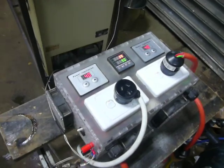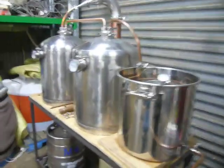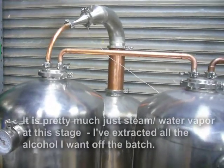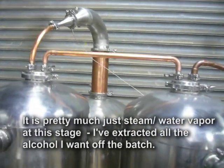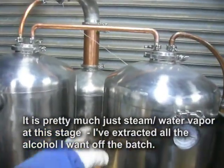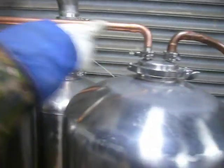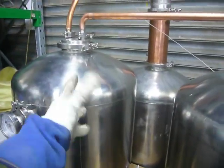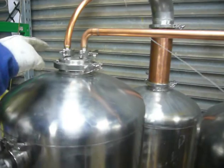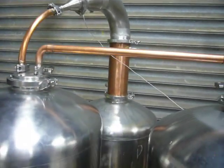Here's the dodgy bit. I've just got the elements back to 40% power so it's continuing to put something through the still. What I've got to do is break the seals for the steam to come out and equalise the pressure — otherwise I could potentially get a vacuum and implode one of the thumpers or the still. So I'm going to break this knuckle here — that will allow this thumper to gas out and neutralise the potential vacuum — and then break this knuckle here to depressurise and remove any potential vacuum back into the still.